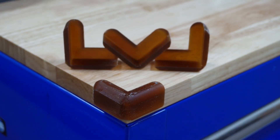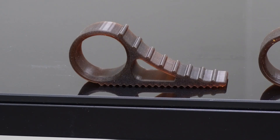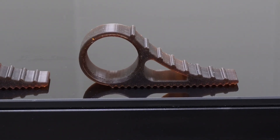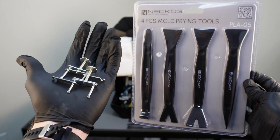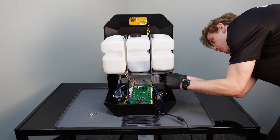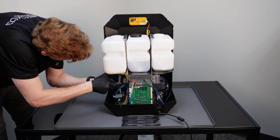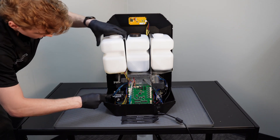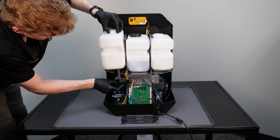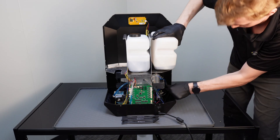But what if you wanted to change materials from flexible to rigid or foam? Wouldn't it be great if you could just swap the tanks? One of the features we've implemented was requested mid-Kickstarter: the quick tank swap. This resulted in needing to change about 30% of our machine design, plus designing a new board, and it took about four weeks of testing just to make sure the machine was durable and worked as intended. You can easily swap tanks to use different materials on the same machine.